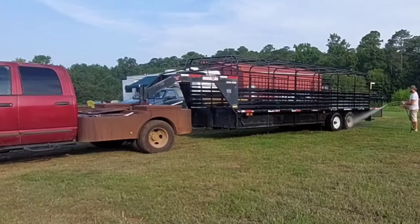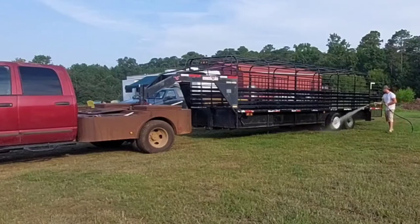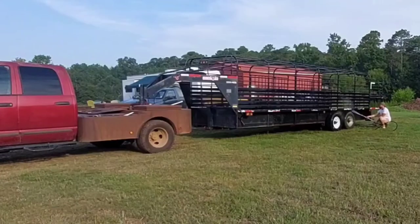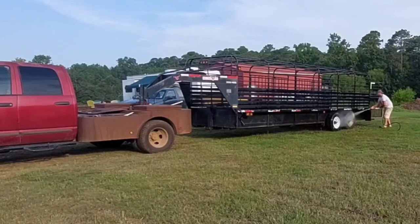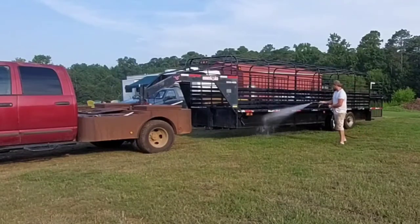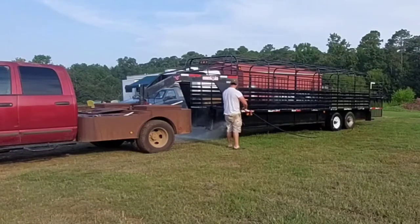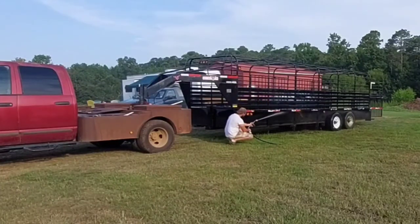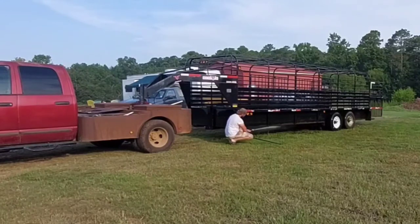I wasn't going to talk about greasing bearings, but I do want to talk about the hinges inside your trailer — that's actually another trap point for a lot of different stuff. You can get a lot of manure in there, and if you don't keep it greased, it will start to build up inside. I've actually put new grease in and had it push out old manure. So I like to wash out those hinges, but only if you're going to actually grease them afterwards. Your bearings should be greased before you ever take off and start working with your cattle.